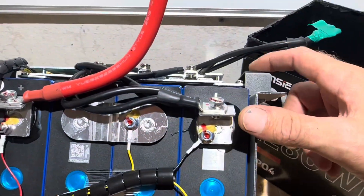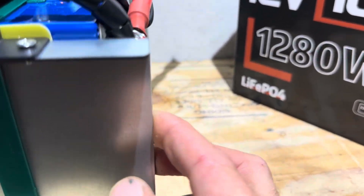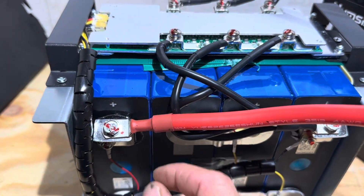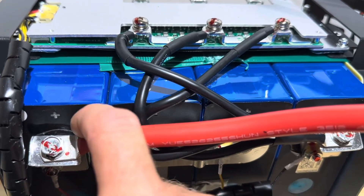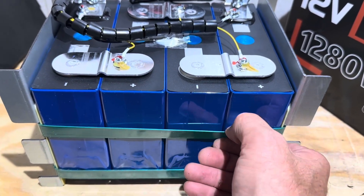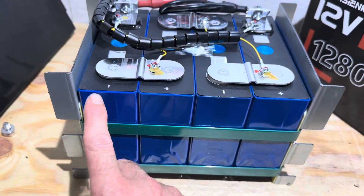I love these with the metal compression on the side, especially with the metal plate on top of the BMS to protect it too. I talked about the terminal connections being near the case, but looking from the side, you can see the metal plate would protect those. They've also applied epoxy to the positive and negative connection — if it got bumped, all that epoxy keeps it glued straight to the prismatic cell. That is some thick, serious industrial epoxy. It's got one layer of fish paper between each cell, no bulging on the cells, brand new cells, super thick tie bands, and metal plates on the side holding everything together. Epoxy board on top from the BMS to the cells, and epoxy board on the side separating it from the metal — no rubbing is going to take place.